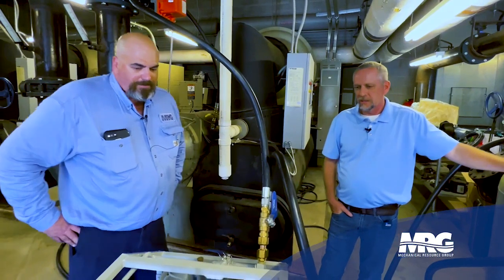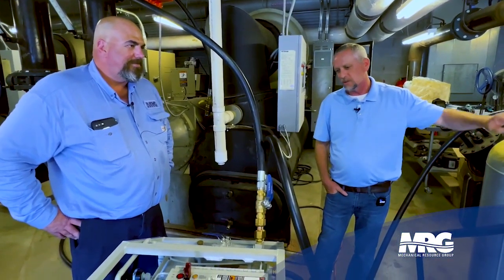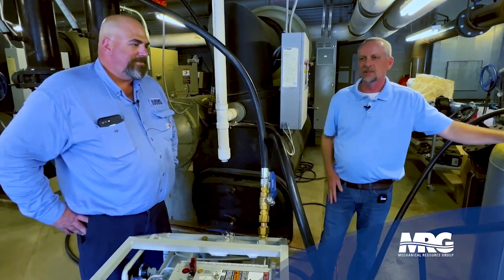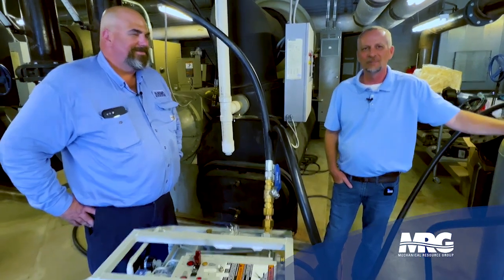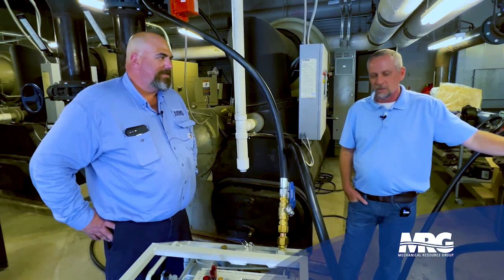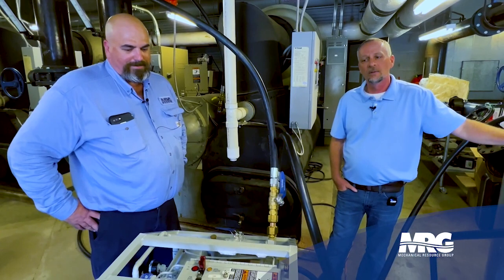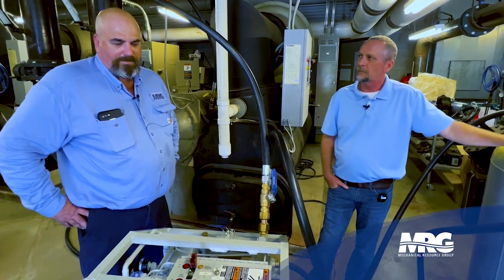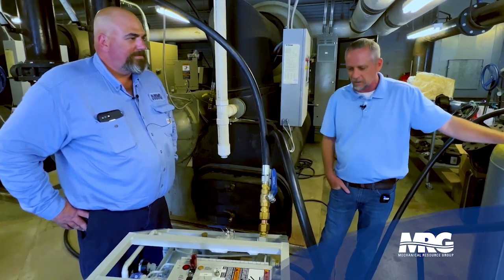Good description of recovering gas and proper methods to prepare your equipment — make sure it's clean, tanks are evacuated, everything's been serviced before you ever turn the first bolt. Make sure we've got our stuff together because you can just compound issues. So we're going to start pulling gas on this centrifugal chiller, do a teardown, pull the motor off, and send it to the motor shop to have it rebuilt.